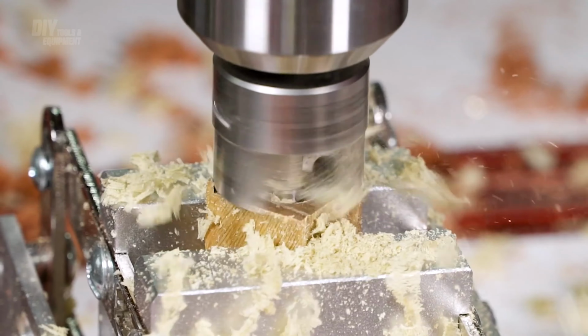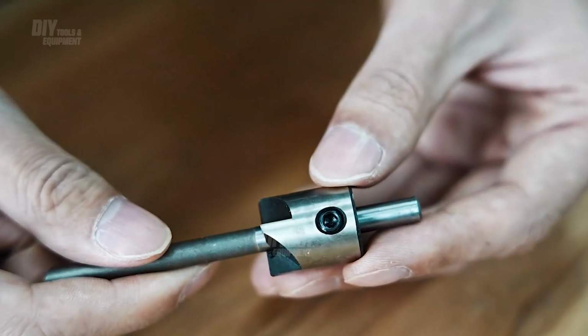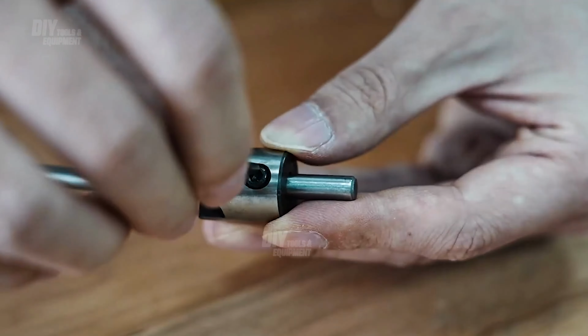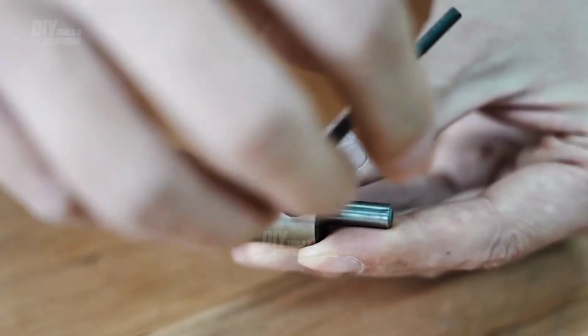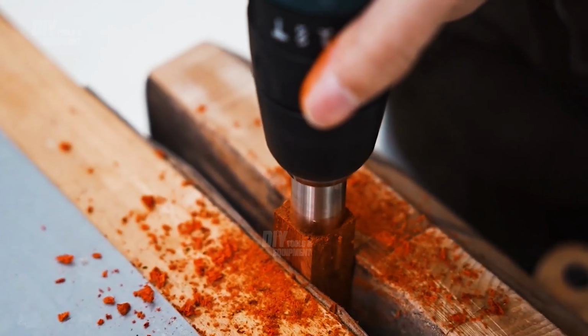Beautiful turned pens demand flawless preparation before you ever mount them on the lathe. If the ends of your blank aren't trimmed perfectly square to the insert tube, you'll struggle with gaps, uneven glue lines, and unsightly transitions between components.